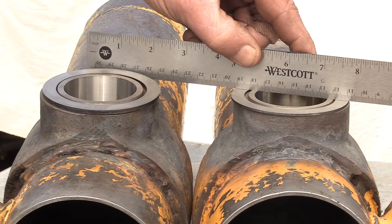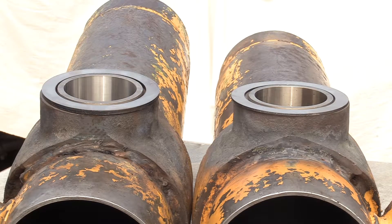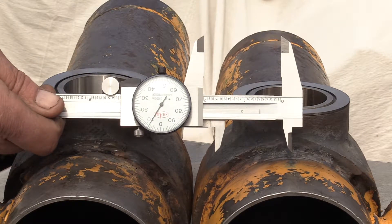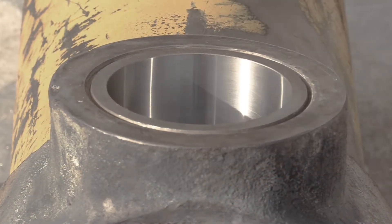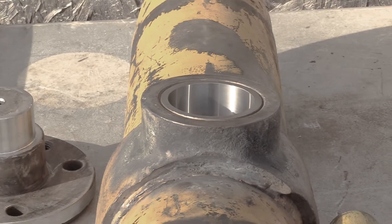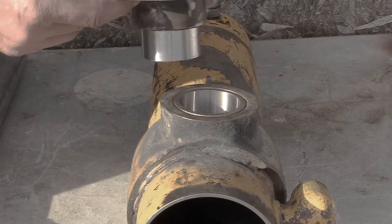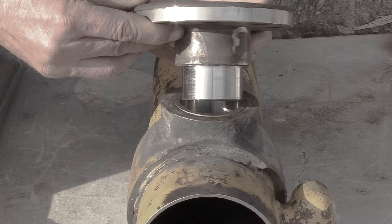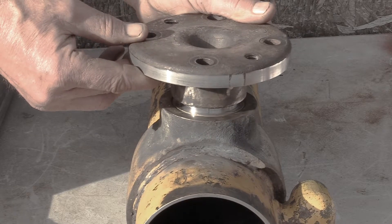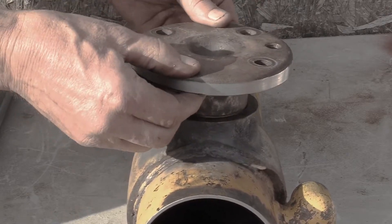Here's a shot of the two bushings in with their arbor shims. The final results are in: we're within two thousandths of being a perfect circle, and there's ten thousandths clearance between this bushing and the trunnion shaft — that leaves five thousandths on a side, which is just about right, enough for the grease. The fit is excellent: there's no extra play in there and it doesn't bind.